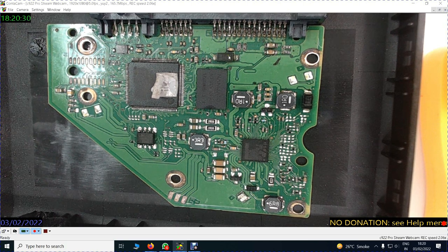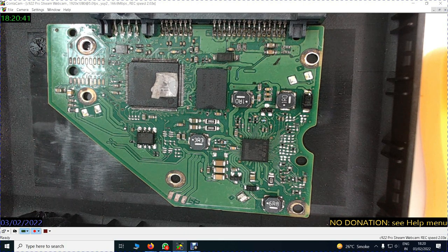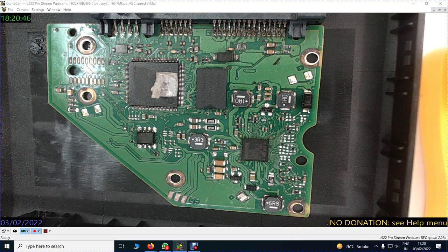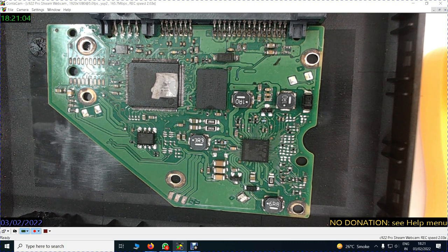Now, similarly, this is the 5 volt side diode. This is the 12 volt side diode. Here, if you measure, you will get 12 volts, and the 12 volts from the other end could be grounded, and from these fine rivets or from intermediate rivets below this diode, connections could be going somewhere else. However, this is called a diode, this is a fuse, this is called a condenser.